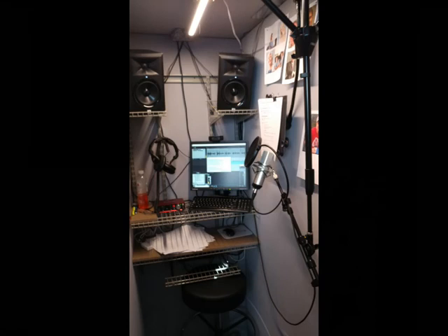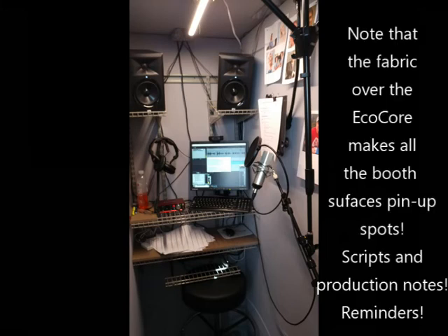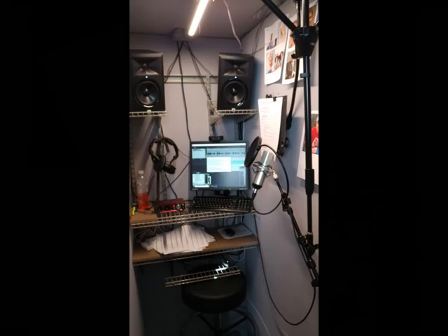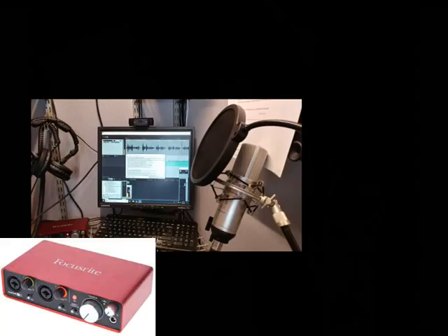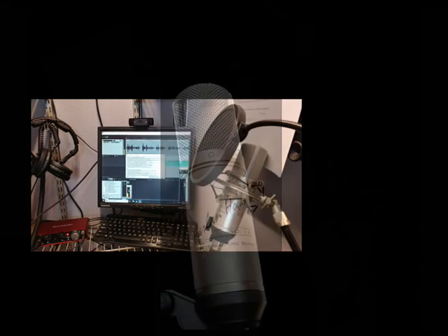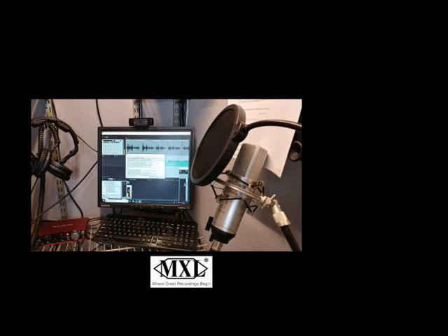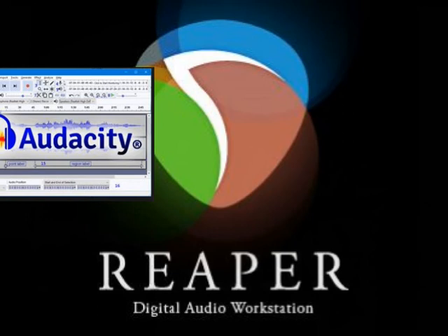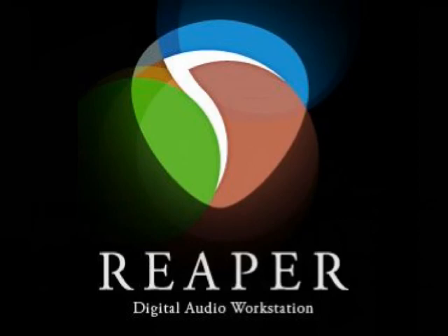Here's the guts of my booth — equipment in place. I originally set the booth up with a two-height table in the corner, but it took up too much room and wasn't flexible. So I wound up putting in some adjustable wire shelving. Angled brackets to mount my monitor speakers — they're JBL six-inch monitors — pointing correctly. Got a good solid headset, and one of those shelf brackets makes a nice hook to hang my headset when I'm not wearing it. I've got my Focusrite 2i2 audio interface, and I've just upgraded to the Harlan Hogan Signature microphone, the V01A — I love that mic. It's a terrific mic with performance of a thousand dollar mic for about $299. My DAW is Reaper. I started out with Audacity — Audacity crashed and annoyed me — but Reaper allows me to do so much more and automate a lot of my audio work.